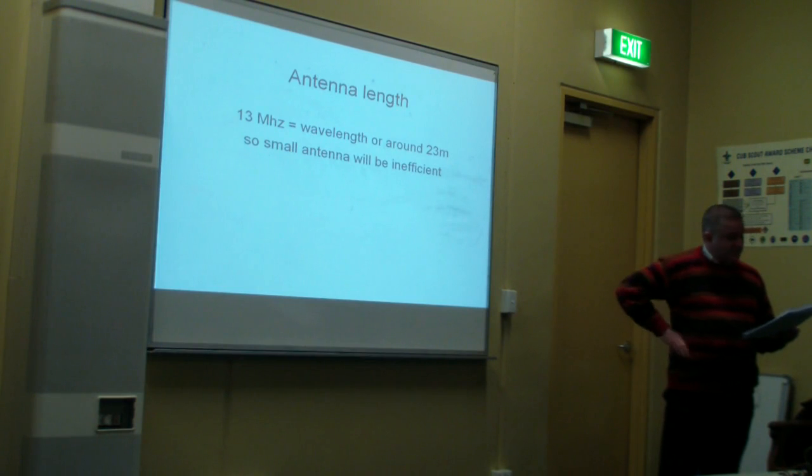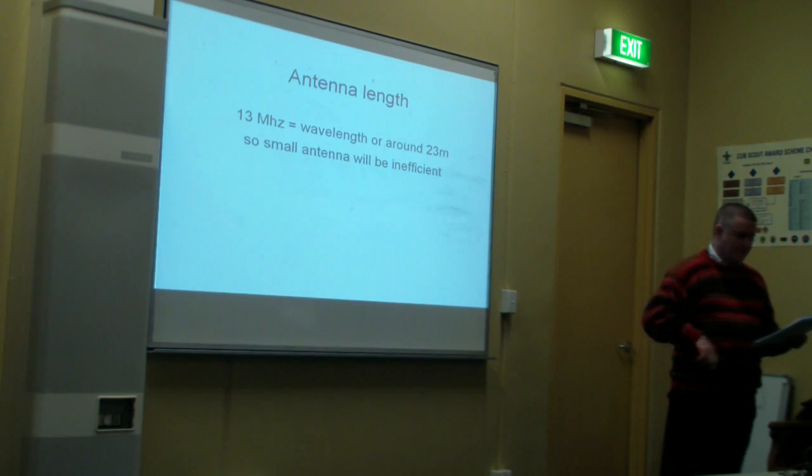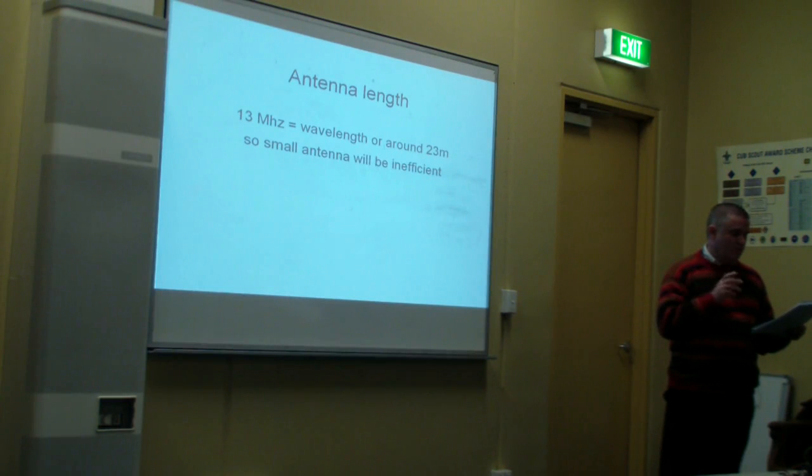So anyway, the first reason has to do with the choice of direct digital synthesizer. The AD9850, I'm told, puts out about 1 milliwatt of power, which is not a lot. Clearly I need a DDS that will put out a bit more power or use some kind of power amplifier.